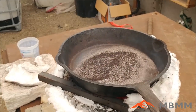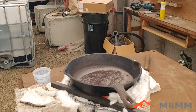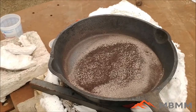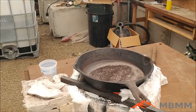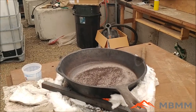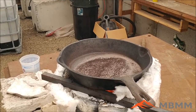It's getting up to temperature — you can see the sulfides in there have turned black. There's some blue smoke coming off; those are the sulfide fumes, the sulfur dioxide. I mixed it with the fine silica sand because it really helps the sulfides not stick to the cast iron pan when you're roasting — if you just put sulfides in there they tend to stick when hot, but the silica insulates them from the cast iron. Almost all the blue smoke is now done. It's really important that you stir this a couple times after it's done smoking because some sulfides on the bottom may not be exposed to oxygen.